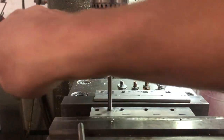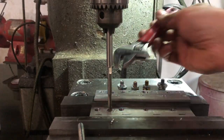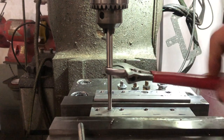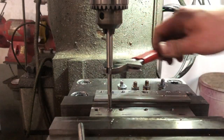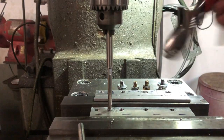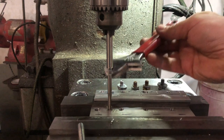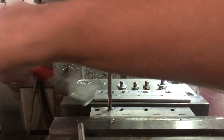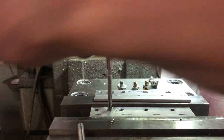And once we get these four tap holes done, then I can put my countersink screws into the four new tap holes, and then we can cut our aluminum pieces into fours, and then we can mill out the dead zone sections that we had bolted together in part three. And we'll get closer to completion.